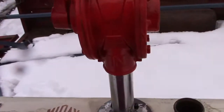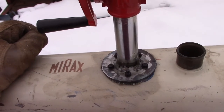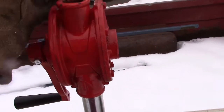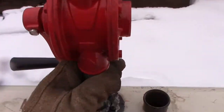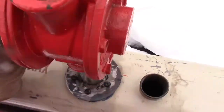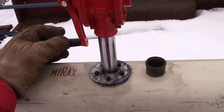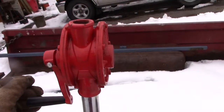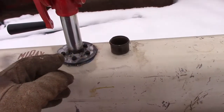Pump's right here. Again, we're not bolted in yet — it's a touch inconvenient this way. Because somehow I've got to get my output. It's going to mean that I'm sucking without a filter before the pump. But it's a pretty horrifying big cast iron sliding vane pump, so we really need a fuel filter after it regardless. So I'm just going to let her eat whatever nasties come out of the tank, and then filter out after.